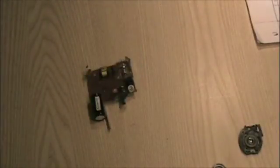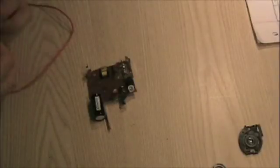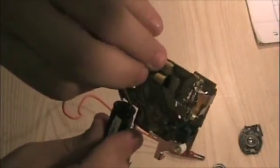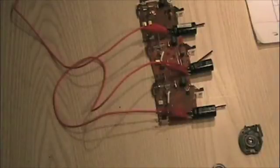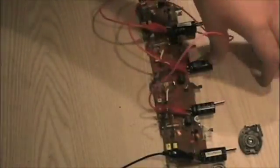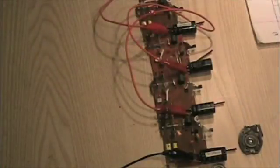All right, well that's all you need to know. Now, just to be safe and to make sure that the capacitor has no charge and cannot gain a charge — because capacitors will regain their charge over time — press it short across the capacitor. This will ensure that no energy will be regained by the capacitor. Now, I'm trying to make a railgun unit, so here you can see I've gotten eight or so flash units that I've taken apart. I'm going to be using their capacitors as well as one charging unit from the board in order to make this railgun.